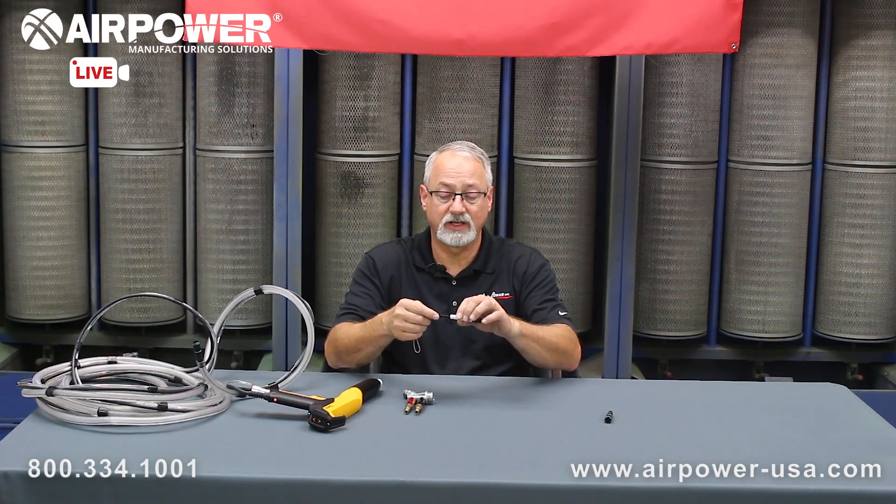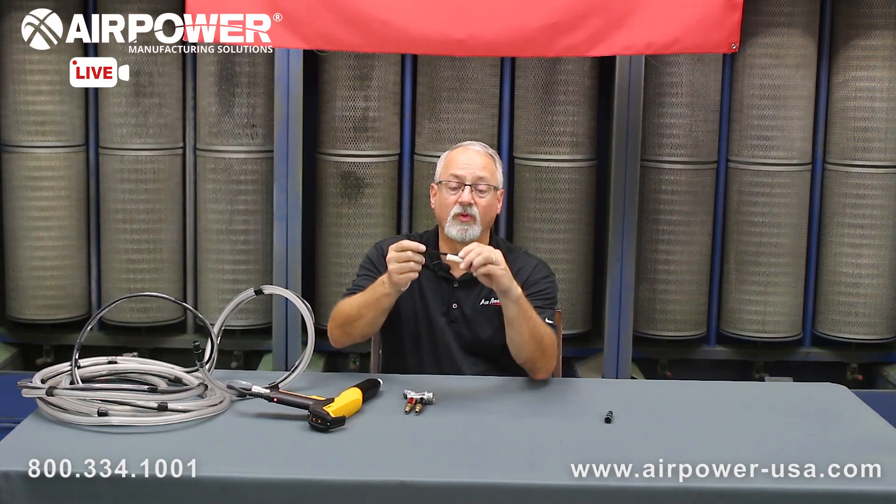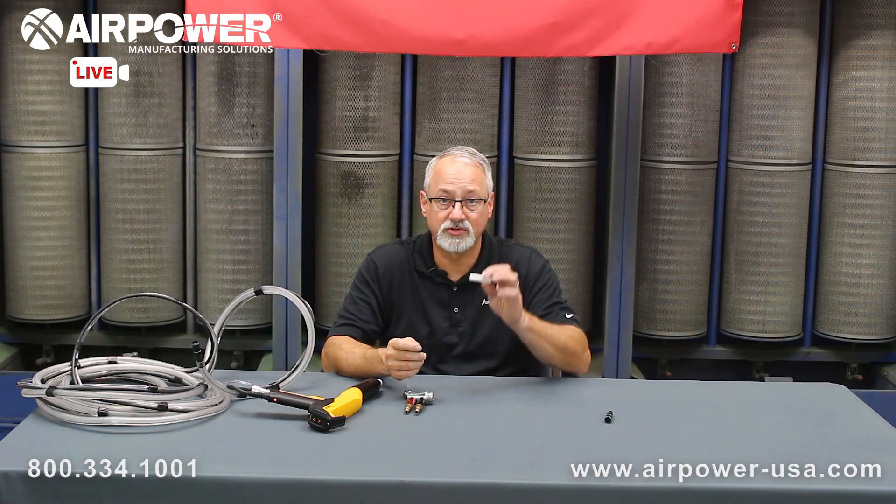For the front mark, stick it here; for the back, stick it here. On the newer units, there's a mark here — if it reaches that mark, it's time to throw this away. If this wears and you're all the way inserted and still spraying powder with it, you're going to have to increase the total settings on your powder percent and total air on your powder unit. You'll spend more money on powder and it's going to blow by on you. So that's a wear item.